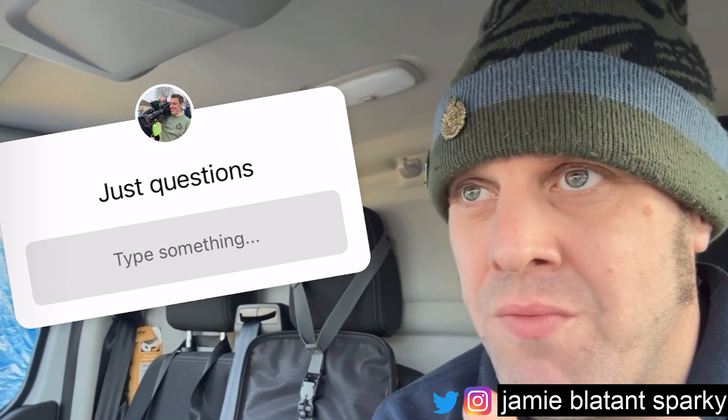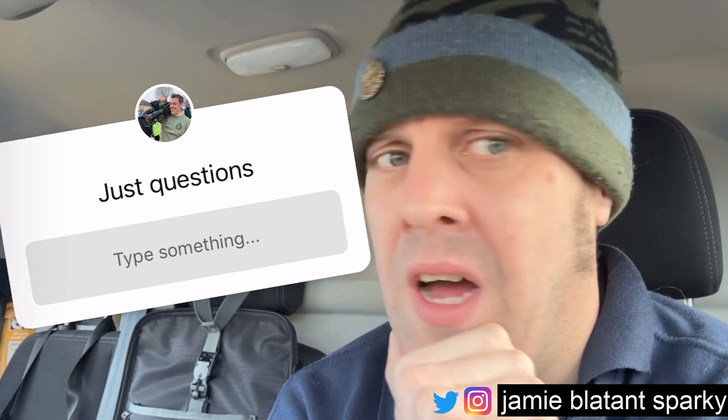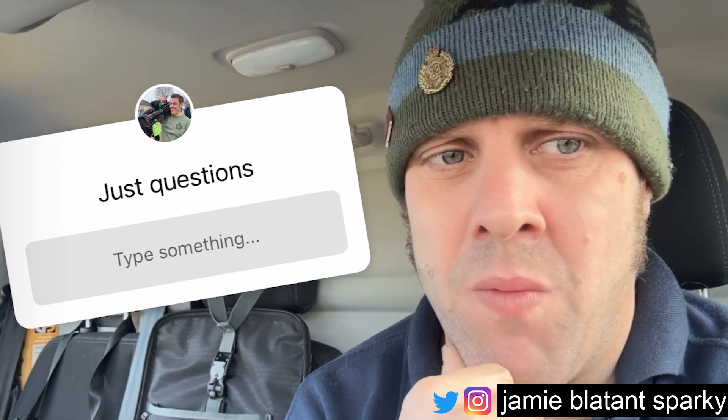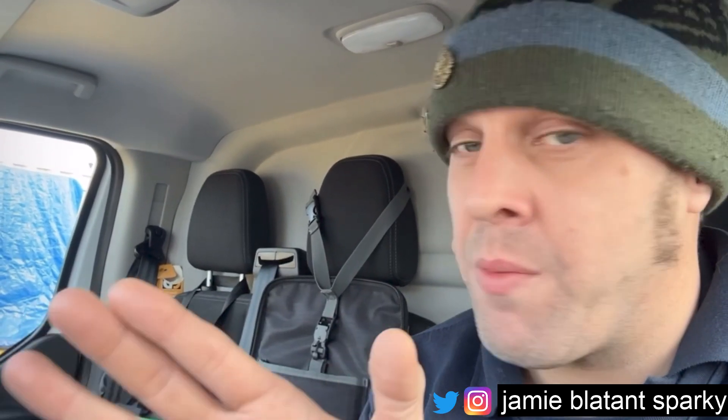That's today's actual electrical content. What I will do is take any questions because I'm going to be sat here for about two hours while we do this work so that the HV guy can turn the HV back on. One last thing - I don't need to know all the science and maths behind it. What's important is that on a site like this there'll be a single line drawing in the substation that shows you how it's all wired. All I need to do when I get to the site is look at that drawing, look at what's on the site, work out what goes where, so that if I want to isolate a certain engine or piece of equipment I know I'm going to take off four pieces of equipment and which ones they'll be.